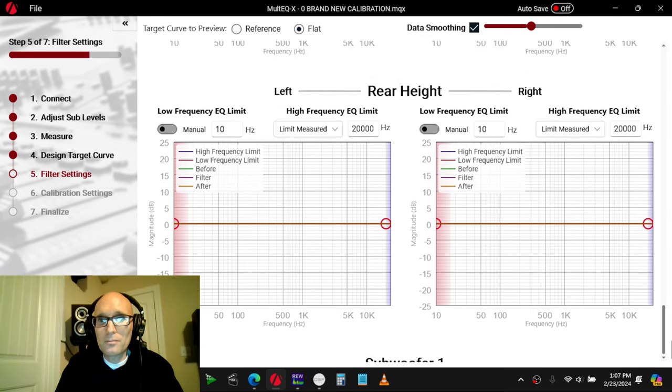So just in case some weird things happen, like I don't know if you've had this with MiniDSP before, you can disconnect, reconnect, and then it will say, "Hey, load what was on board," and it was not this calibration whatsoever. So I've learned the hard way, and I've lost calibrations because of this as well. So as long as you always have a backup of this. Now, typically what I do as well is I apply it to 2, 3, and 4. Imagine we had a power cut, and when it came back on, for some strange reason, it got set to number 2. Well, number 2 contains this calibration as well. So that's what I use my other banks' save presets for, to make sure I'm using the correct calibration.